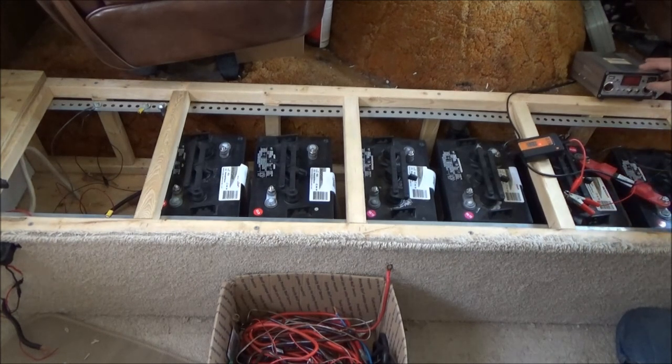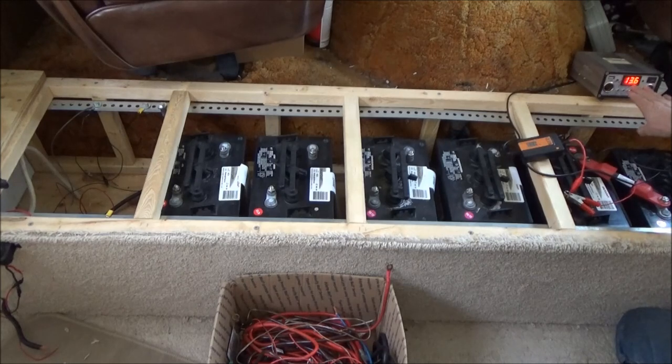I've had them on the Harbor Freight solar panel system with the Harbor Freight solar charger. This is not really a good charger but it works for now - it's quick plug and play, you just pop in the wires and go. Looking at 14.3 and rising volts in the sun right now - 14.4, 14.5. The power is going way up as I watch.